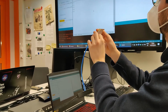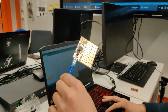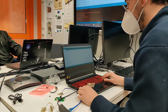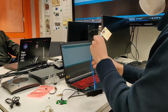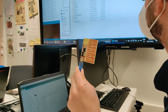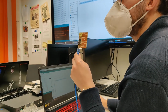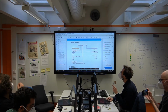Okay, there's a value here, and let's put my fat finger. Yeah. There's clearly a difference. So if I detect this difference and display it on the LED, I have a little functional prototype here. Yep. So this library only works if you have a capacitive touch pin. Yes. In theory, you could use any pin if you added the right resistor and things like that. Oh yes, you can do step response by yourself. But I really like the fact that they have it all embedded like that.